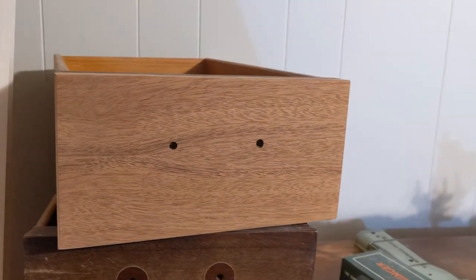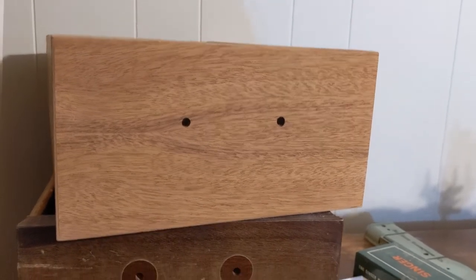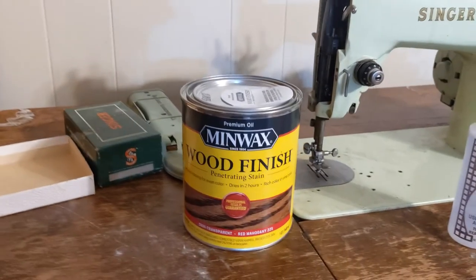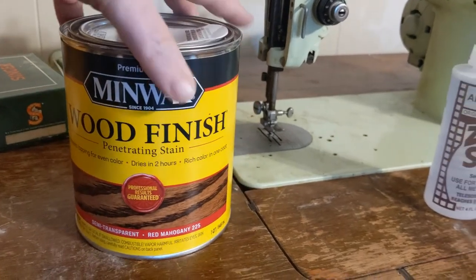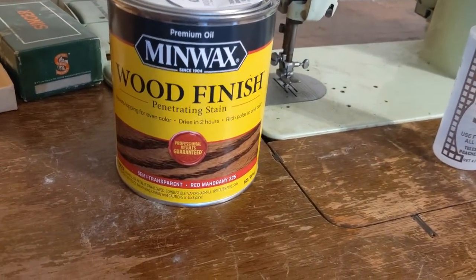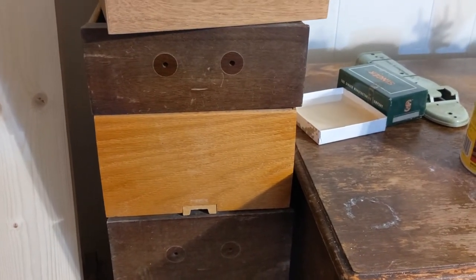There's the first drawer sanded down nice and smooth — the old stain and lacquer came off super quick and super easy. So that was the before and the after. As far as the stain, I will be using a red mahogany, which will help bring it closer to the natural color of what this was, because it does have a lot of red undertones in it. I have a whole bunch more to do, and it's a little cold outside so I'll be waiting a couple days before I get going more on those. In the next video I'll show you what they look like finished.